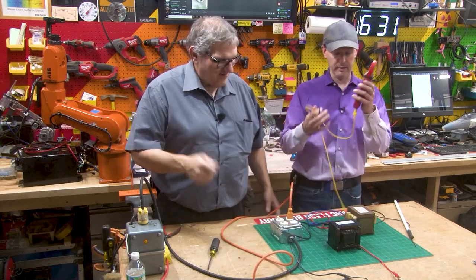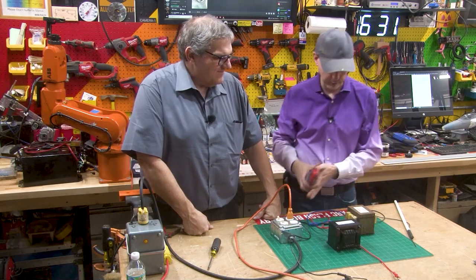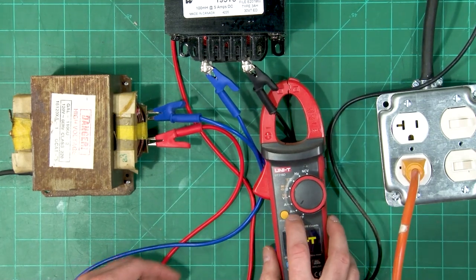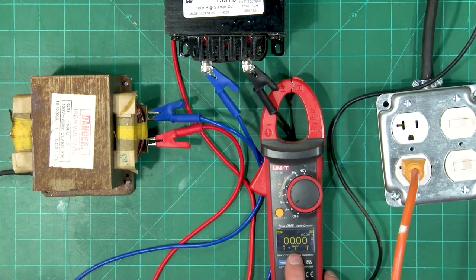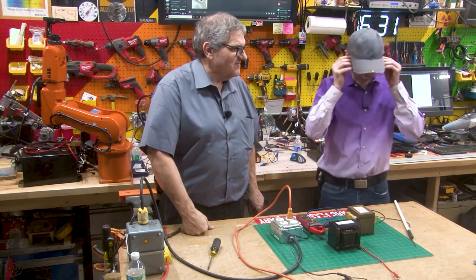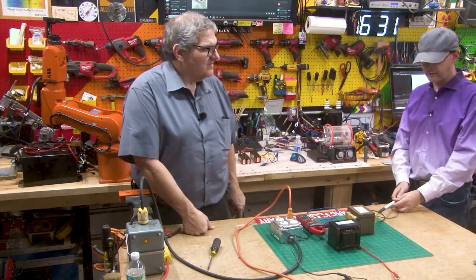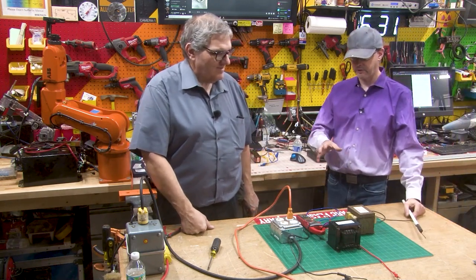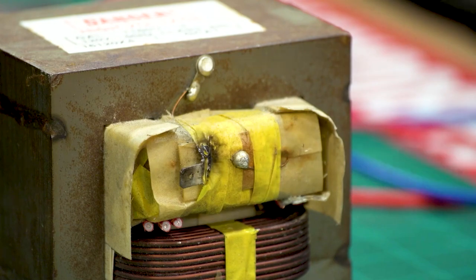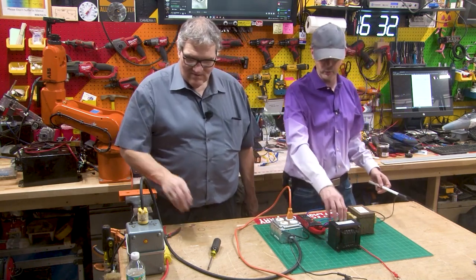The kid at home — you get a power strip with a 10-amp breaker, that'll at least protect you a little. So I'm going to grab current right here and set this to wavy A's — AC amps — so they can read that and see the current we've got going on. I'm going to grab my shades for safety. Now I'm going to actually try to pull an arc on here. I don't even think we'll get much of an arc at the first level with it restricted so much. If I can't get an arc, I'll just touch this on and hold it there — that'll give us the maximum amps because I'll be running into a dead short. That'll tell us exactly what this will limit to at 120 volts.